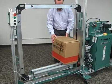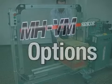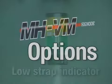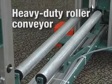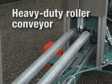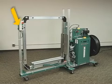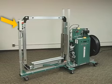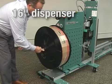You can further customize the MHVM to suit your operation by adding a variety of additional options, including a low-strap indicator with light tower to alert the operator to low strap conditions, a heavy-duty roller conveyor, portable operator controls that can be placed on either side of the machine for easy access in any production situation, and a 16-inch dispenser to accommodate larger strap coils.